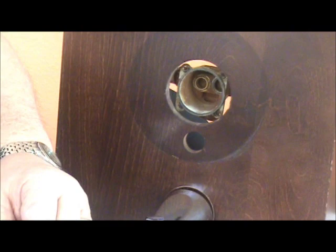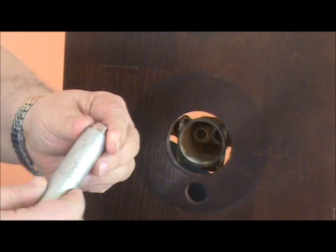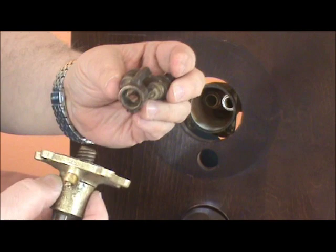When you put everything back in, you don't want any leaks. A little Teflon tape or Teflon paste is recommended to make sure you get a positive seal. Putting the seat back in — I happen to have a tool here that we've had for a long time, made by Kohler, basically an 11/16 socket with a deep well. Just screw that back into the housing and snug it down. You can put pliers on there just to make sure it's nice and tight.